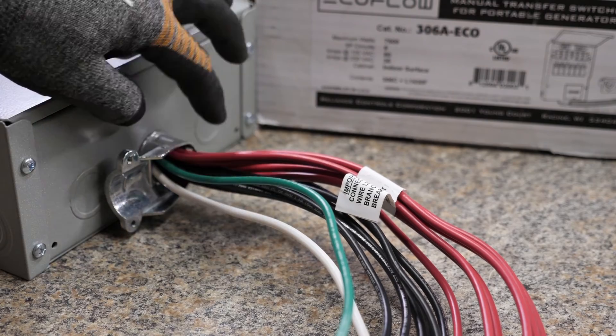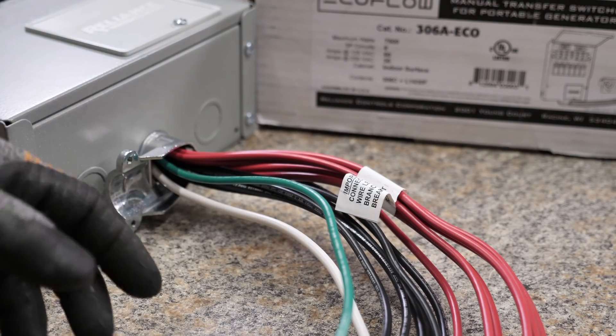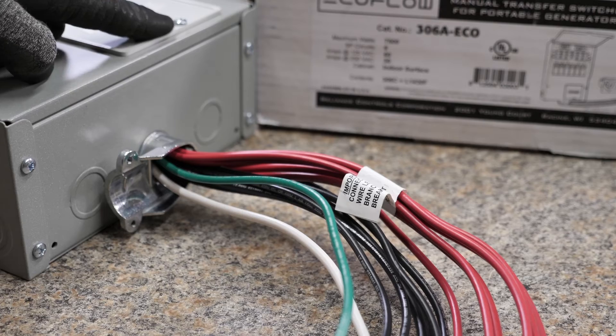The center is off, and if you leave it down, that's basically grid or pass-through mode. So if you have a storm or something coming in and you just want to automatically go to backup power, you just come down to wherever you have the panel installed and flip that up to generator power. Out of the bottom of the box, you have all of your wiring. Everything's pre-wired except for the plug, which we're going to do in a couple of minutes.